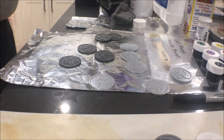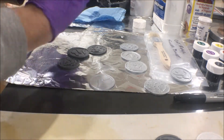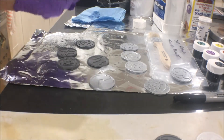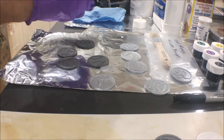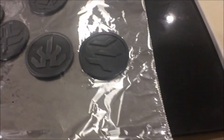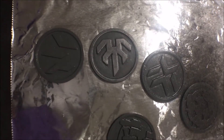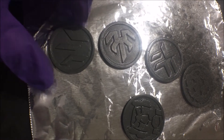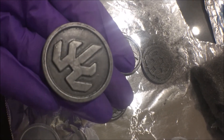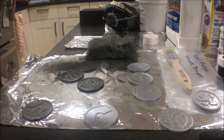To finish a cold cast like this, get some mineral spirits, put it on a paper towel, and wipe down the surface of your casting — it helps soften up the resin a little so the buffing works better. Then take some steel wool and just go to town on your casting. I buffed for about 10 minutes — you don't have to be gentle, just rub as hard as you can. On one side you can see the raw casting, flat and dark gray because of the So-Strong pigment, and on the other is the buffed one. I wanted it more metallic, so more steel wool, more scratching and buffing.